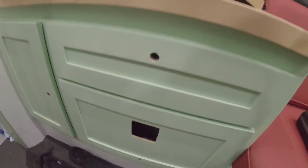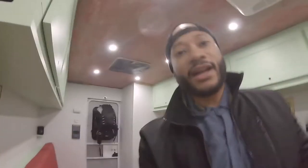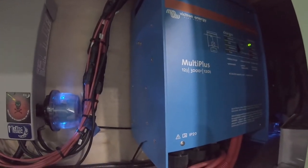Take into consideration the size of your cabinet — decide on your fans wisely and you should be good. If you go on the AC Infinity website they give you a sizing chart to give you a guesstimate of what you would need to cool your cabinets. Think about the high-heat, high-demand stuff — that's why I have a bigger fan going in this cabinet, because there's a lot of heat especially when you have your solar going and the AC on.